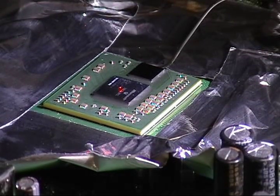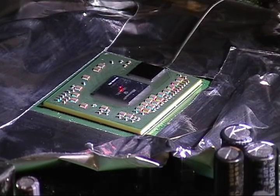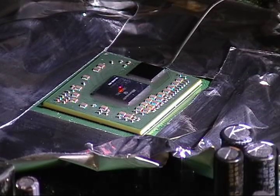So I'm going to go ahead and start my lower heater, put it on fast reflow. Now it's at 26 degrees Celsius right now. Once it hits 110, I'm going to swing the upper heater over. I usually turn the upper heater on to fast reflow once it gets to about 90 degrees, but I've noticed that I'm going to start doing it around 70 degrees just because I want it to be hot. I don't want it to be still warming up when I have to flip it over.